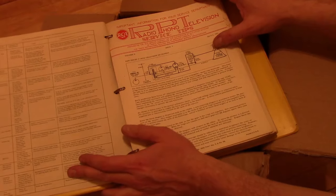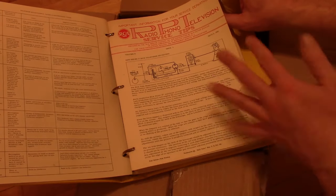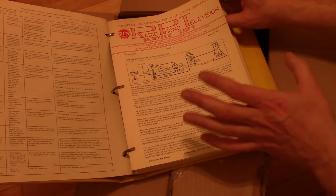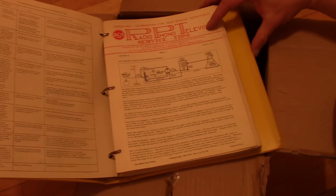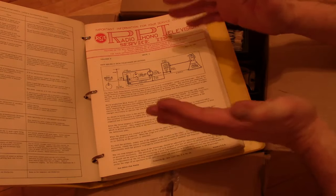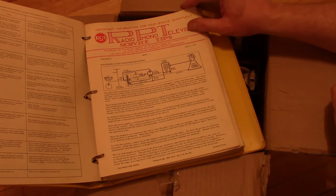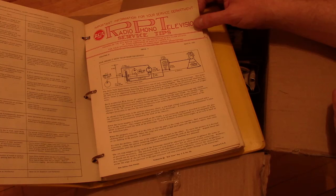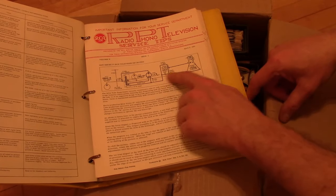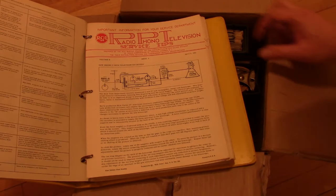I'm making reference here to the early metal cone picture tubes. Prior to around 1950 or so, all the CRTs were entirely glass, and as they got bigger and bigger they were quite heavy. So somebody had the idea to make part of the picture tube out of metal — the business end where the electron gun is is glass, but the rest of it is a metal cone, except for the glass on the front of the picture tube. This saved a lot of weight and let them make larger and larger picture tubes, but the potential problem is that the high voltage goes right to that metal cone, so if you're working on one of these and the set is turned on and you touch that, you are going to get zapped.